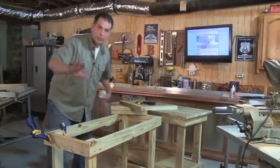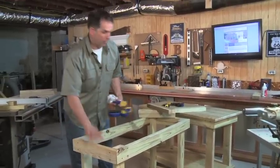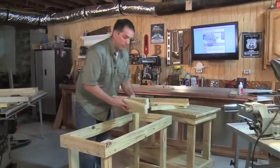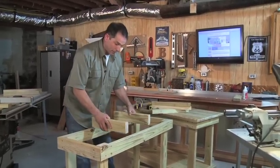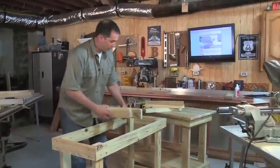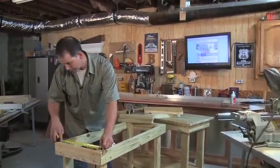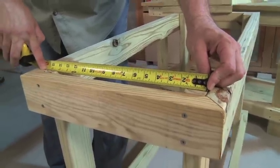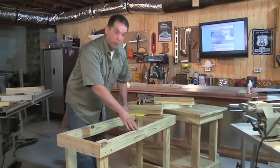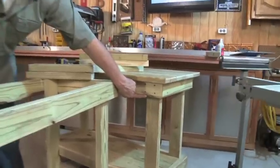Don't hesitate to spend a little extra time on these joints. Use the clamps to pull them tight, then put the screws in, and if you have to do some adjusting, spend the time — it will be worth it. The next step is to put in our bracing. We're going to use two by twos across the bottom and a couple of two by fours across the top. To get the right length, divide the top into thirds and put those braces in at the appropriate measurements. Take your tape measure and measure the distance from the outside to the outside leg. That will give you the exact inside distance and will correct any bulges or warps in the wood. Make sure that bottom screw stays out of the path of that router detail we're going to do in just a minute.